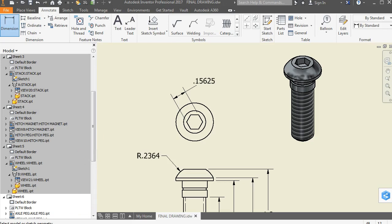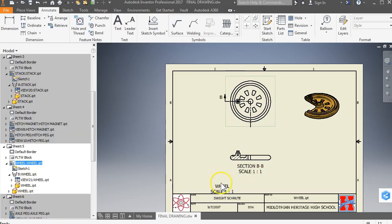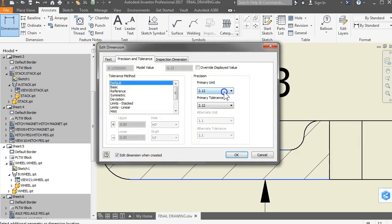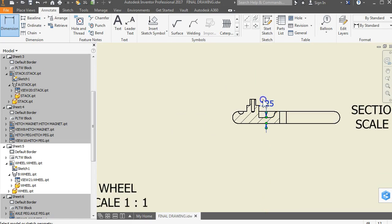Let's take a look at the wheel — I'll have several measurements associated with this projection. I'm going to drag this over so I have some room on the left side, reposition this back in the lower left, and move section B to this side since I'm not doing measurements there. One of the convenient things to show is dimensioning from this side to this side and pulling across — this looks like it would be a three-digit number. Let's drag it up a little bit so now we know the thickness of that piece.